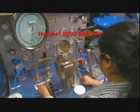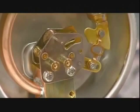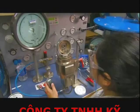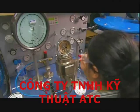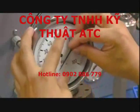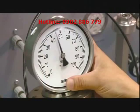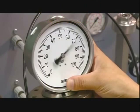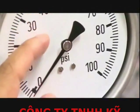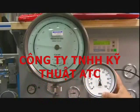Next, a worker calibrates the assembly. She loosens the connecting link slightly to prevent friction, puts on the indicator needle, and runs a test. After a bit more adjusting, she puts the faceplate and indicator needle back on. She ensures the gauge reads accurately at three key positions, then screws the faceplate onto the gauge. A final test confirms it is calibrated properly.